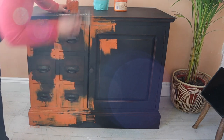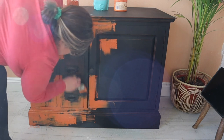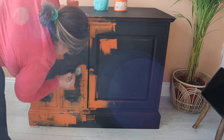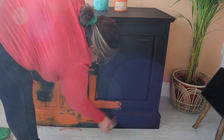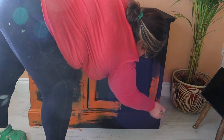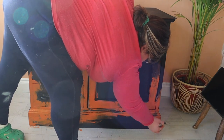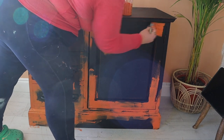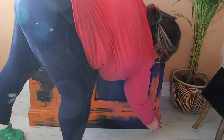With my very thick paint mixture I'm just applying it on with a natural bristle brush — this is a premium chip brush from Dixie Belle. This is going to give me lots of texture that, when I distress back, will be visible through the green paint. I'm concentrating it in the areas I want to see orange, especially around the bottom, and I've also applied it thickly on some of the door edges and drawer edges. Random application is the key — the last thing you want is a really uniform look. Apply your paint in some areas really thickly, in other areas a little bit thinner, and also use a combination of brushing and stippling. You can also use a spatula if you want a really heavily applied textured base.